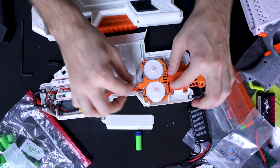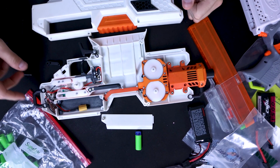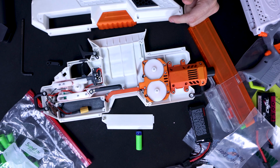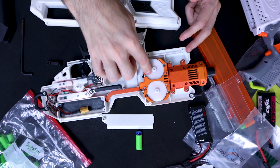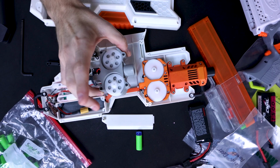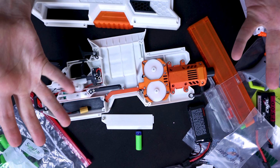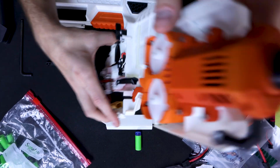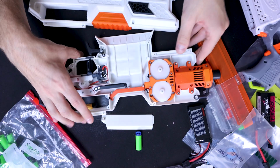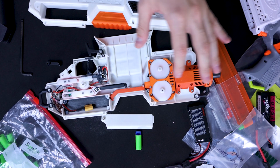It's much closer to the Twilight kind of geometry that we sell over on Foam Pro Shop. And then the addition of this extra piece here means that every bit of this blaster is clearly designed for injection molding, because that's their eventual goal over at Band Blasters, from the draft angles on the speed feed lips here to the way that the cage is built so that it could be injection molded as opposed to machined a la Nick's. This only works because it's a 3-op part on a CNC. This could clearly be done in a mold. That single bore access makes your shots that much more accurate, as the cage itself acts as a guide into the stable barrel. So everything about this is really nice.